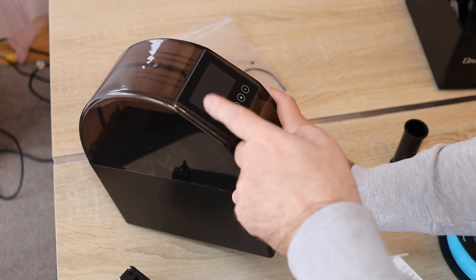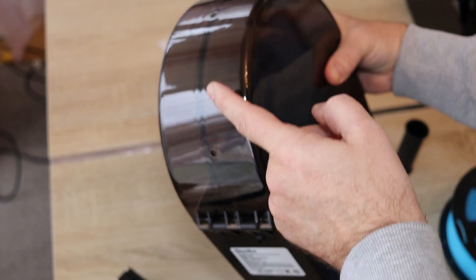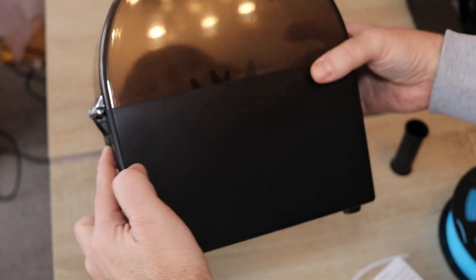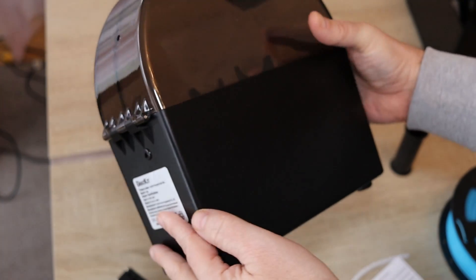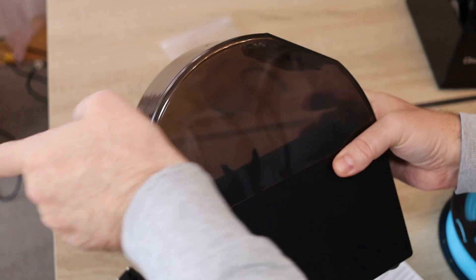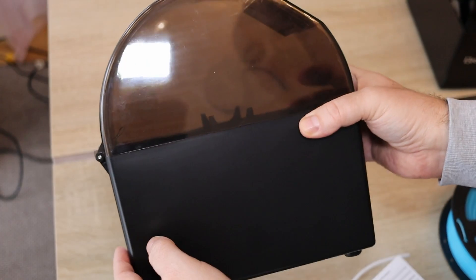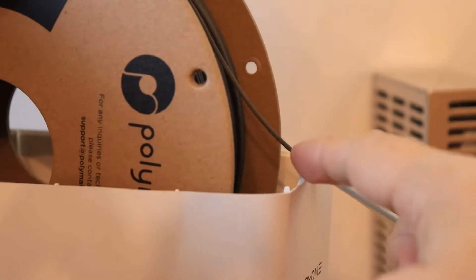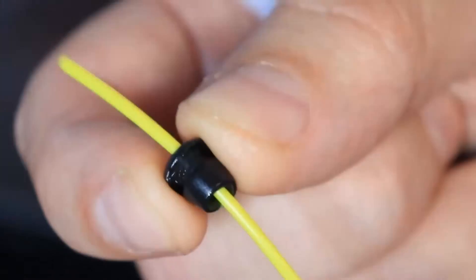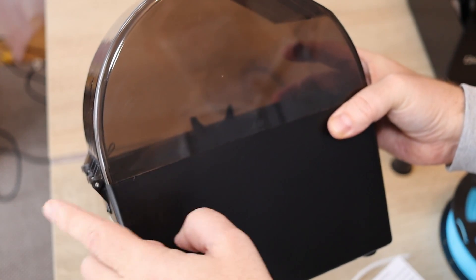From the outside we have the screen, the power plug, the exit for moisture — which I think should be on the top and a little bit bigger — and this is the only exit for the filament. Look at this: it is almost at a 90 degree angle. These companies must learn that the exit from the filament dryer must be tangential. Because in this case the filament must make a 90 degree turn before it exits. Imagine nylon with carbon fibers — it must make a 90 degree turn, resulting in extremely high friction, this rubber will wear very quickly, and if the material is brittle it may snap inside the dryer before it even exits.